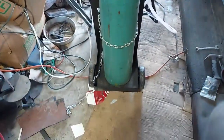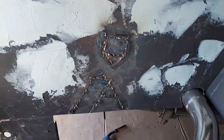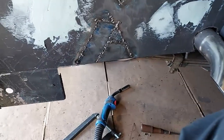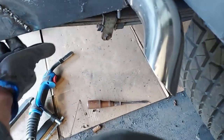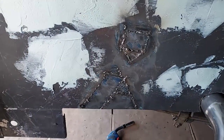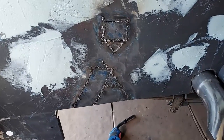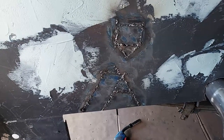New bottle of gas — 75 bucks, that'll last a while. Well, here are our little patches, tacked in. I got a couple small little beads on them; it made this pretty strong. Of course it'll get much stronger. I gotta put something back here and bend this away from the hinge — I'm still alright but it's awfully close. So now I'll just put my helmet on and start doing little one, two, three spots on it, move to a different place, move around, try to keep it cool.